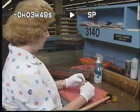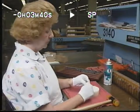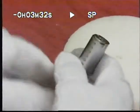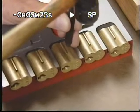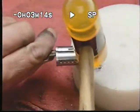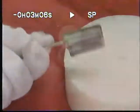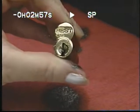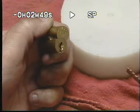Following the steps just outlined will help you locate and correct the vast majority of problems you may encounter. However, in working with the cores, there are also a few basic practices you should always follow to avoid causing damage to the core components. First, use Teflon blocks or equivalent material to work cores loose — never use metallic blocks. Don't stamp the core markings with harsh or excessive force. Always stamp the core markings on the solid or upper half of the figure eight core. Always use a plastic headed hammer when working with cores; never use a ball peen or other metal hammer. Only strike the core on the solid lobe. In an uncombinated core, use LPS lubricant to lubricate and flush out the core; before combinating, make sure the LPS has dried. In a combinated core, use graphite as the lubricant. Best Lock does not recommend mixing wet LPS lubricant and graphite.